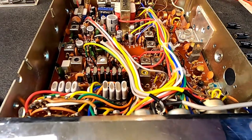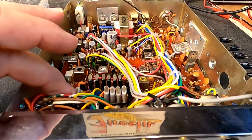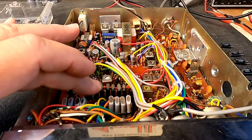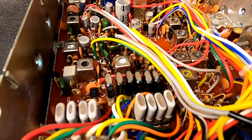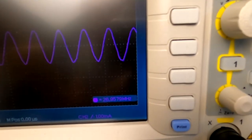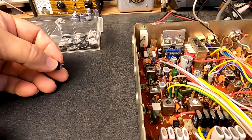I do not have a way to properly check crystals here, so what we're going to do is use a CB radio. I'll leave a chart showing how these are mixed up at the end of this video so you guys can take a screenshot. I troubleshot it down to this row of 37 megahertz crystals. This is the OEM crystal — a 37.600 crystal, if I remember right. So I'm going to key it up on channel one... we're at 26 nine five seven, that's about eight KCs off frequency. So I'm going to pull out this old one — this says UNIDEN, because UNIDEN made these for Pierce-Simpson, which is why these are such a good radio. So there's the 37.600 pulled out.